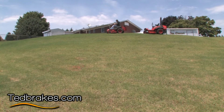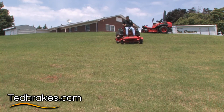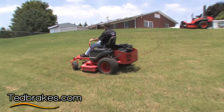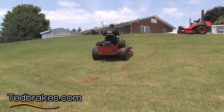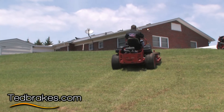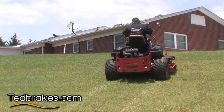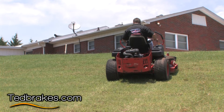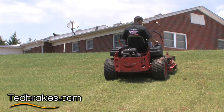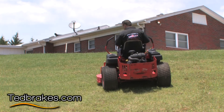We're going to go down on this hill and show you what happens with the service brakes. We're on approximately 16.7 degrees and the standard states that you should be able to move your handles to the outside and your machine should not move more than two feet in 24 hours. So in the neutral position with it running it's not moving very fast, but now we're going to shut the engine off and pretend that we've lost power. This is where the service brake is supposed to be holding.